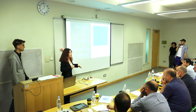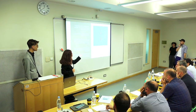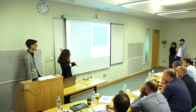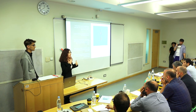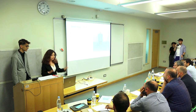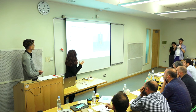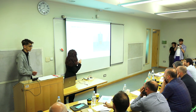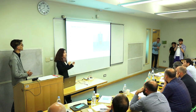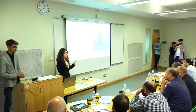In none of the cases were we able to actually do the required movement, meaning to detach the magnet from one disc and attach it to the other. Just the coil would move because of the magnetic forces. So we realized that we need to improve the core, so the pen. The first thing we did was replace the plastic core with thick copper wire, because when we would supply power to it, it would heat up and deform, which was not ideal.